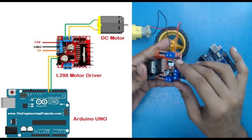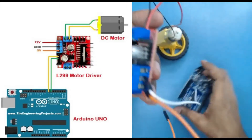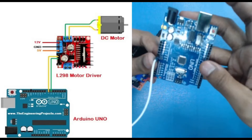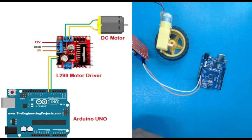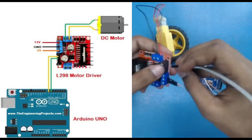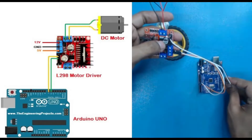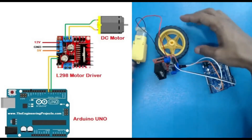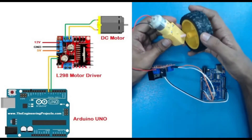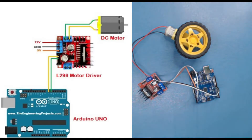Now we will use the control pin area — the third and fourth pins — and connect them to the digital pins of our Arduino so we can control the motor. Let's use male-to-female jumper wires and connect them to pin 8 and pin 7 on the Arduino. Let's also attach the wheel so we can see the rotation and direction. Now let's go to the code section and write some code.